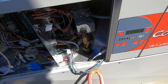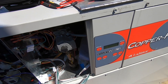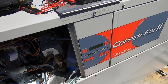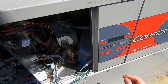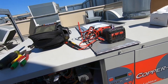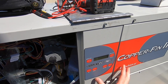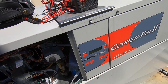So this one was pretty easy. It's just like a capacitor on a split system unit - one little thing knocks out a boiler or knocks out a condenser, nothing too crazy. I'm showing you how to troubleshoot it and what to look for: ohm out your HSI, take your amp draw. If your boiler doesn't display your flame signal, you can find it on your ignition module - usually they'll have pins on there you can test, or you'll hook up your meter in series to get your micro amp measurement. That'll do it on this one - pretty simple, pretty straightforward. We're on stage one, already maintaining our set point using two boilers. In the early mornings this building definitely needs both boilers to operate efficiently - now we got the smaller one back on. We're good to go, see you on the next one.